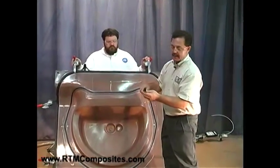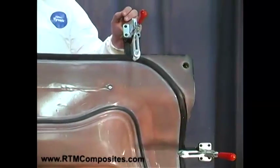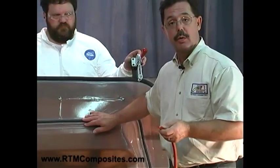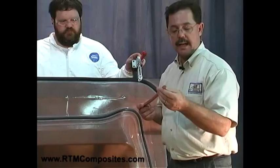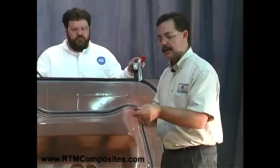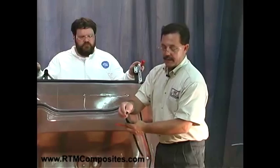This is a cross section of the seal at the outer edge — what we call the wing seal. We offer the seal that goes into the mold. Here we have the resin channel seal, or the primary seal — in this case it's the dynamic seal. We obviously need the right size groove so the seal has the right tension upon it and does its job. We have the dynamic seal profile; that profile is laid on the calibration wax — another video shows how to build tooling and work with calibration wax — but the point is that's what creates the exact size channel or groove that the seal fits into.